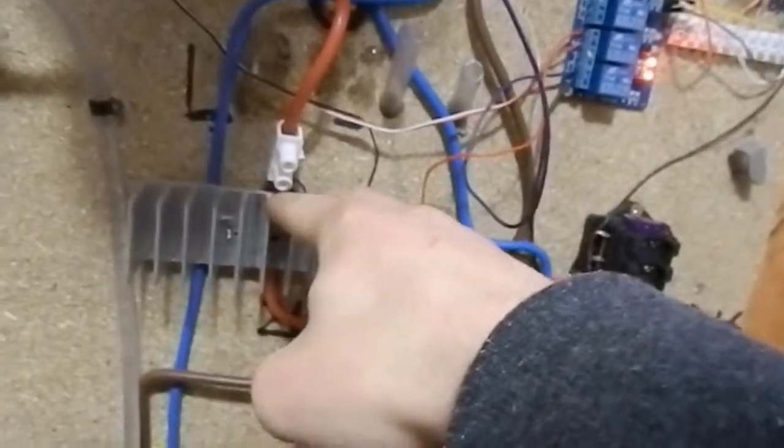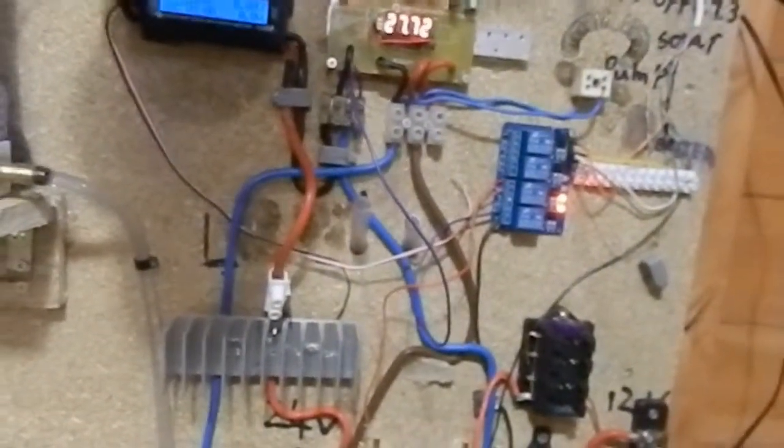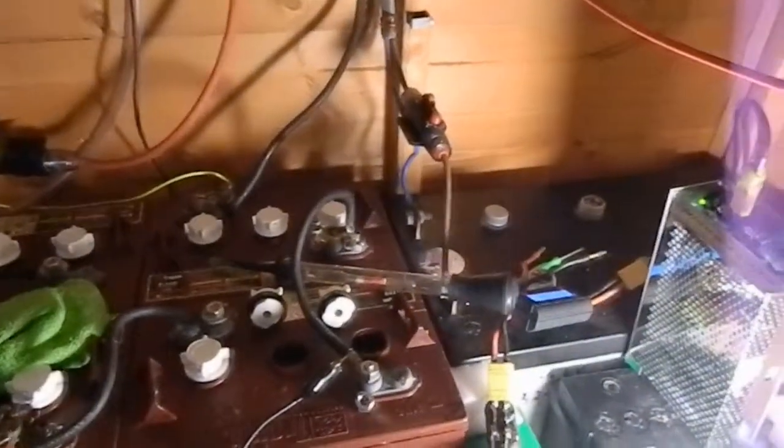It is currently night time so there's nothing happening today. That is my huge blocking diode — it can take 60 amps, but my solar panels will probably only ever hit 40 amps at 24 volts if I'm really lucky. Thanks for watching, and I hope it brings home how important temperature compensation on batteries actually is.